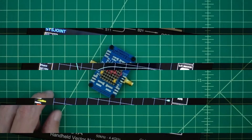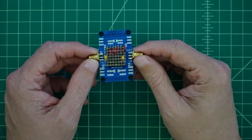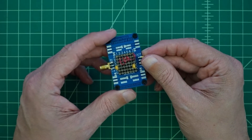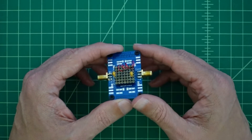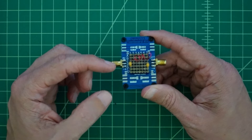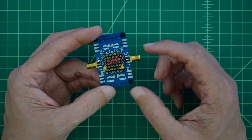Here's the circuit that we built, and this is on a NanoVNA test board kit. I've done other filters on this board — it's really nice for prototyping. You have an input here and an output here, and you feed your signal through whatever circuit you want to put in there. The holes are all connected in specific patterns you have to know. This is a very simple pi network: we come in, we have a capacitor shunt to ground, then in series we have an inductor — it's an ugly inductor but it kind of works — and then another capacitor shunt to ground.